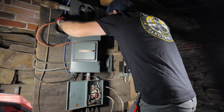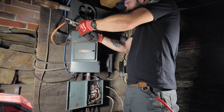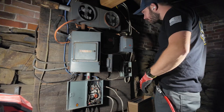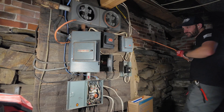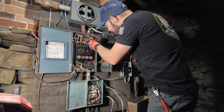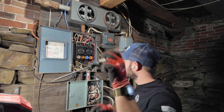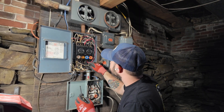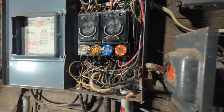The meter up there - one of them is active, the other was an old one that's been disconnected. That whole top portion is going to go away. This is a multi-phase project - we're upgrading in phases, with this being the first phase, getting all these circuits figured out. The meter disconnect will be relocated outside with a typical service mast on the outside of the home and the new feed will be brought in.